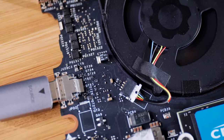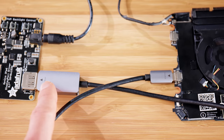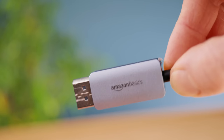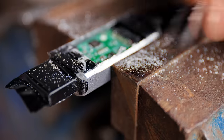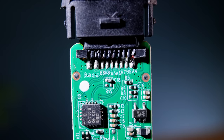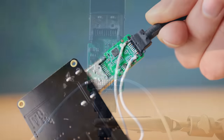Sadly, there's no obvious place on the board to tap into for this additional power, but I have an alternative idea. The USB-C to DisplayPort cable is an active one, which means there's powered circuitry inside the DisplayPort end that will be receiving 5V from the USB port. Annoyingly it's encased in aluminium, so to get to it I'm filing down the sides to safely cut through the top layer so that it can be prized off. The wires here are somewhat small, but we can quite clearly see that one is labelled as ground and the other as A4, which according to a USB-C pinout chart is the voltage supply. This gives us a 5V source to tap into, which is just enough to power the displays directly.